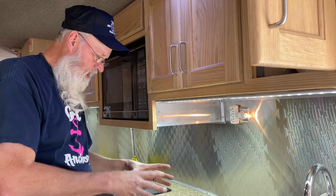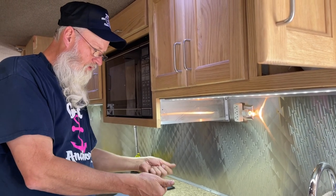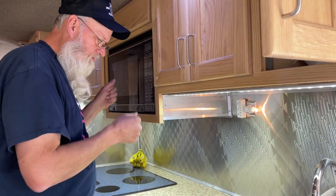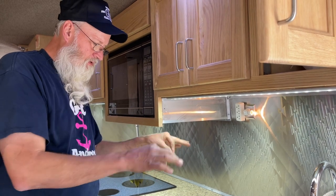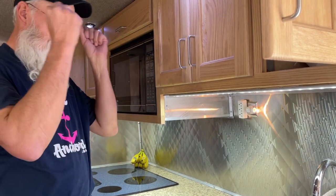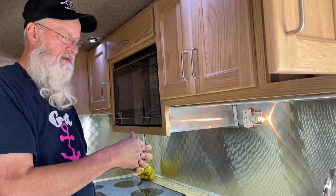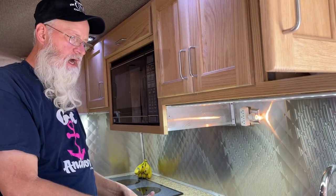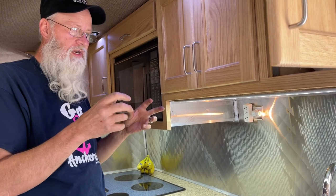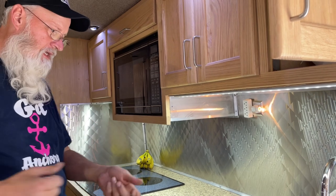What I'd do is put a tub with a Ziploc bag in it, fold the Ziploc bag over the tub, pour one pound of Part A and one pound of Part B, zip it shut — and you have about 30 seconds to knead it, squish it around. Then I'd throw it behind the walls in the bag and it'd drop to the bottom. I'd hurry with the drill motor as fast as I could, start screwing all my screws — they were already pre-started — lay it back, throw it in the wall, and start screwing the panel on.